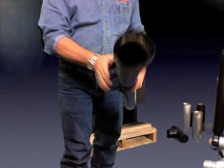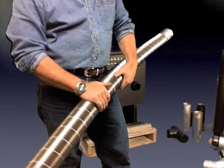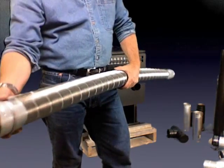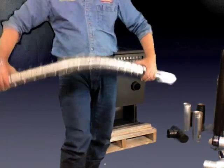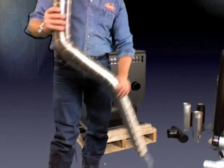When you get inside of a masonry chimney, this is what you want to use. You want a stainless steel flex system — that's what you need, and this will enable you to do that. This one flexes all over the place. You can bend it around, up and over, and go up this way and then you're into that chimney system.